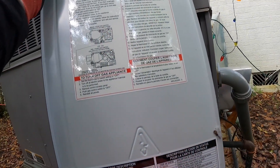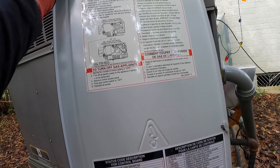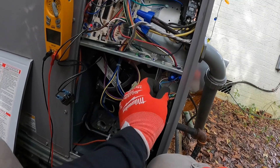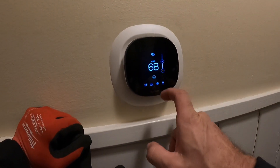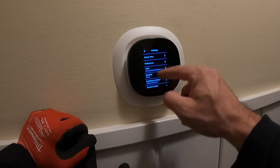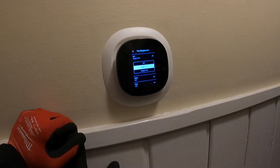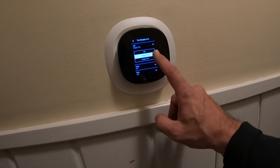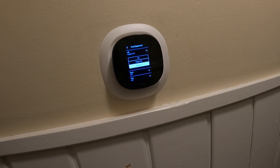That light is on — it says normal operation. We're getting one flash which says 'check fuse.' All these connections look good. Alright, thermostat's on. I think there's a way to test it, so we're going to go into installation settings, test equipment. We're going to do AC stage one — I heard it kick on. And this is a gas pack so there's no reversing valve, so everything that's going to be energized on the low voltage side should be energized. This is a two-stage air conditioner.